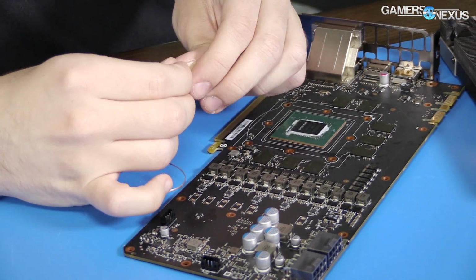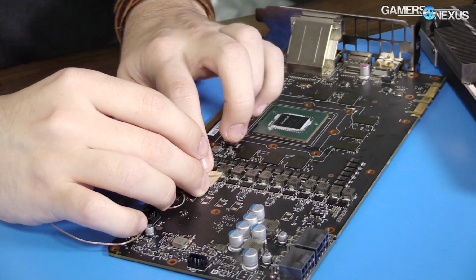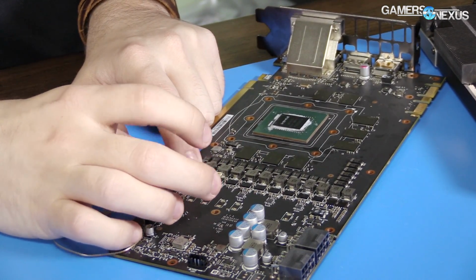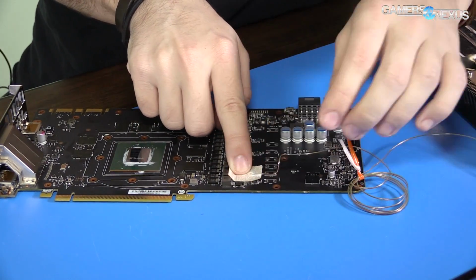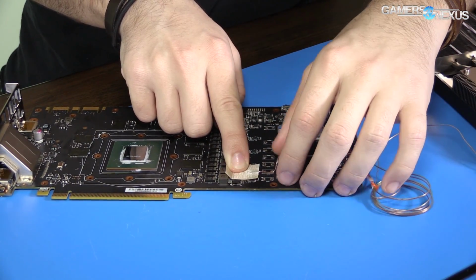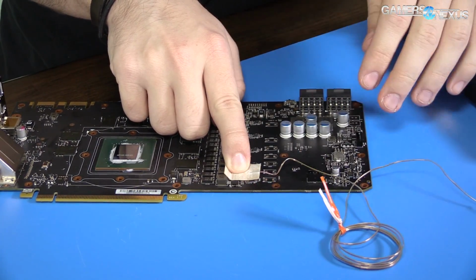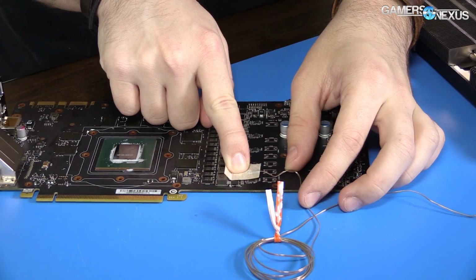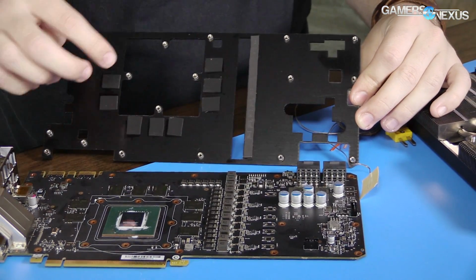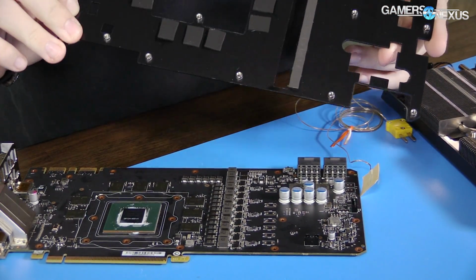The thermocouples used are flat and self-adhesive from Omega, as recommended by thermal engineers in the industry, including Bobby Kinstall of Corsair, whom we previously interviewed. We explained in a previous video why these flat thermocouples that have the adhesive on them do not pose issues for thermal transfer between the FETs and the thermal pads that are included on the card, and how they're not electrically conductive, so that's also a good thing. We also talked about avoiding EMI in that previous video, and that was basically the preparation video for this one. So if you're curious how the testing was set up, go there.